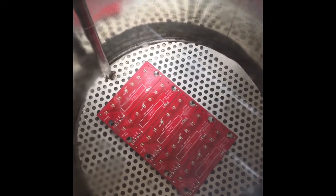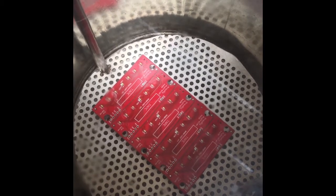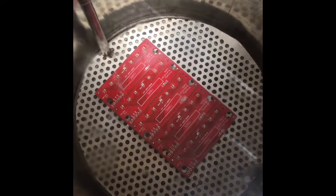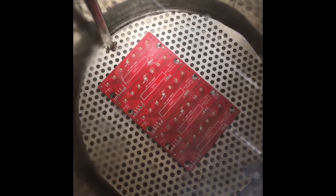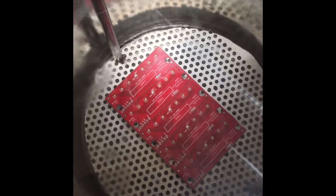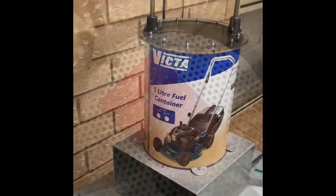All you have to do is wait 10 minutes. That's what it looks like on the inside — you can see the Galden is boiling away merrily. It'll soon start to make a vapor and then we won't be able to see much of what's going on, but usually you can see when the solder starts melting and that's a good indication. I say 10 minutes because in our ambient temperature, which is normally quite warm, that is enough. If you live in a cold area you might want to leave it a bit longer. It also depends on how heavy your parts are and how heavy the boards — this is a 1mm board. If you've got a really super thick board it might take a bit longer. Just keep an eye on the time, see when the solder starts melting, give it a minute more and you know you're good.